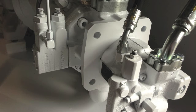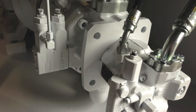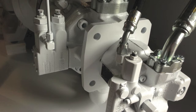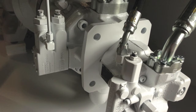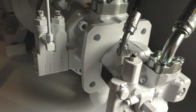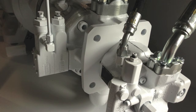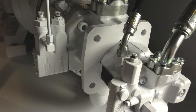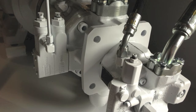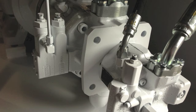The larger pump in this photo is your tool pressure pump, or more specifically the A10VSO140DFR pump, identified as number 8 on your schematic. It is a 140cc pump and at 1800 rpm it can provide approximately 63 gallons per minute of flow. This too is a pressure compensated piston pump but this particular pump has been outfitted with a DFR or load sense style compensator. The DFR allows you to set the maximum pressure of the pump but also provides better speed control under varying loads on the tool pressure portion of your circuit. The DFR does this via a pressure signal coming from the quarter inch line plumbed to the left side of the DFR compensator.